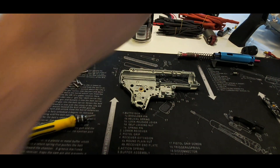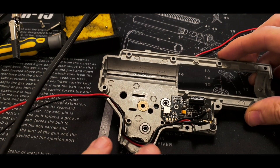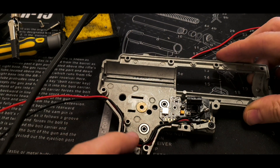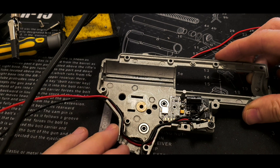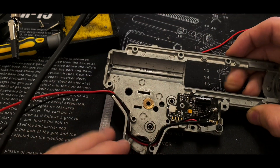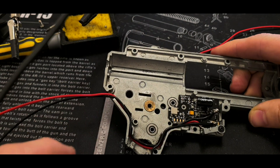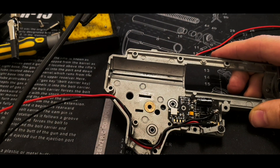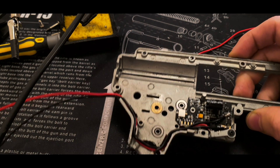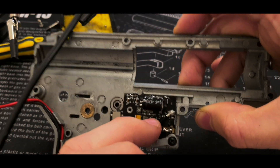As you can see, we have two positive wires from the Deans connector — one is going down to the motor and the other is the signal wire going to the V positive. The black one, the negative from the Deans, is going to the V negative. Sorry I couldn't do a time-lapse soldering video — I'm not a master at soldering and it's really hard to do with the camera positioned this way.